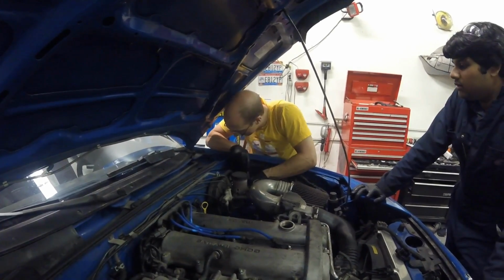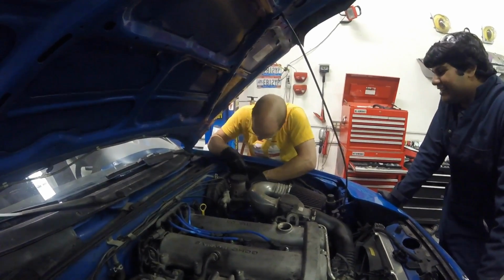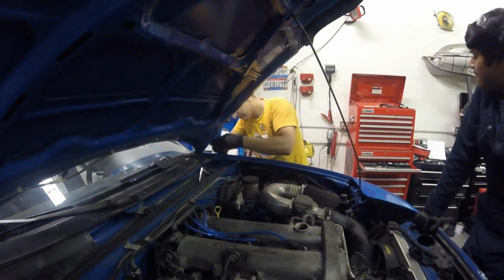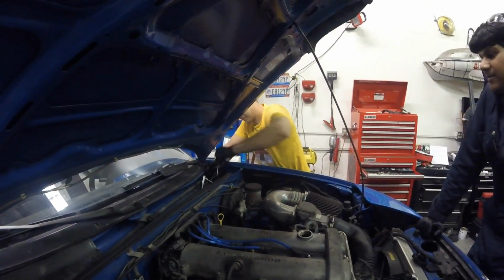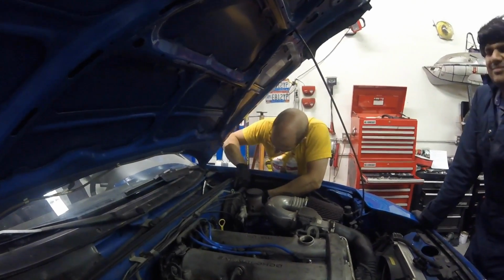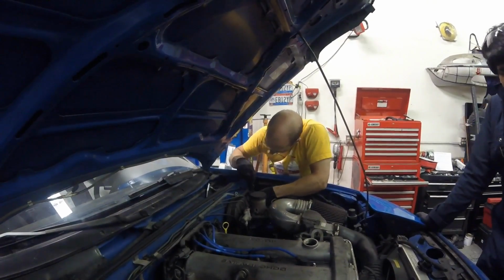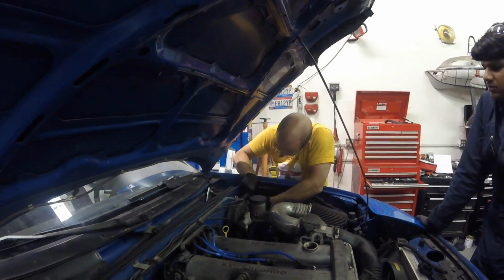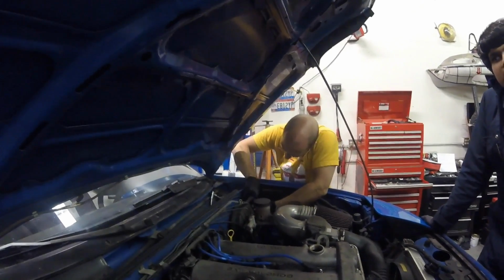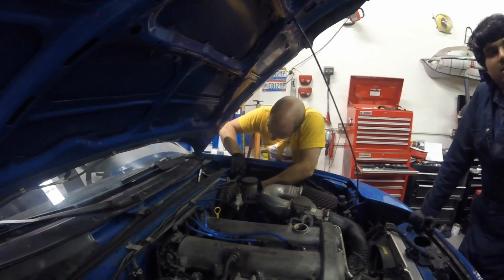Doesn't use that size. Oh, they use every size. Most of them are the most common thread pitch, but there's some stuff like the banjo bolts into the coolant lines. They'll be like M14 by 1.5 instead of something bigger, a really fine thread pitch. And then the banjo bolts on the brakes are like M12 by 1, really super fine thread pitch. Interesting. The finer the thread pitch, the more torque it can hold.